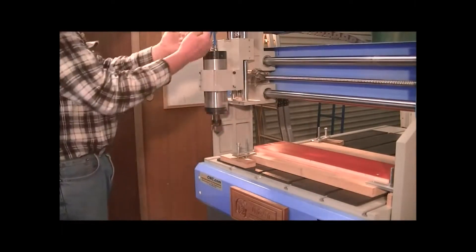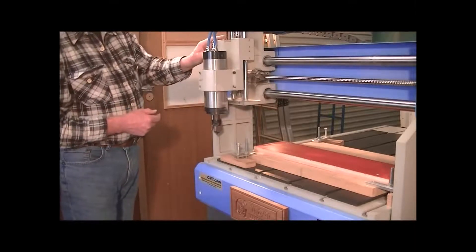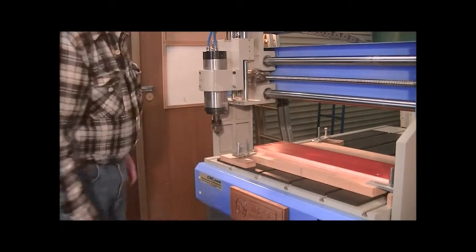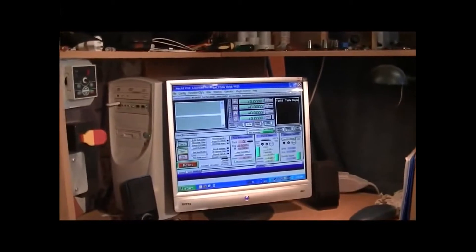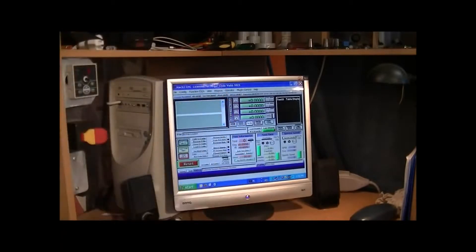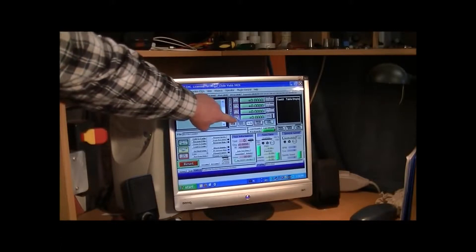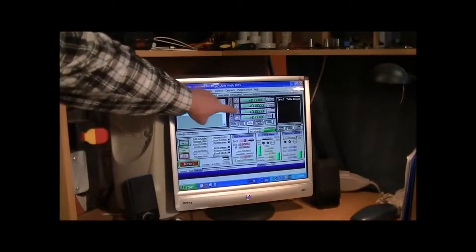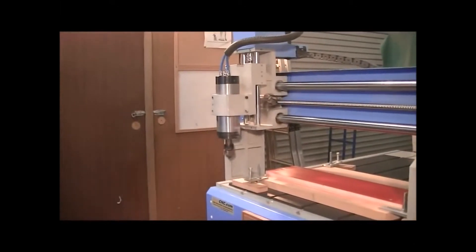The spindle is as high as it touches the limit switch. There's a limit switch here, a limit switch in here, and a limit switch inside here. That registers as all zeros on the DROs — that's digital readouts for the X, Y, Z, and A or fourth axis. All we're concerned about is the X, Y and Z axis. So that is the machine zero, or the home position.